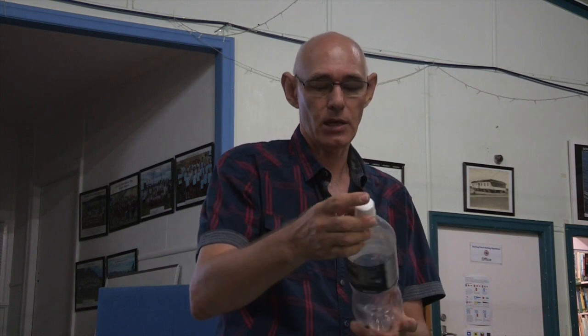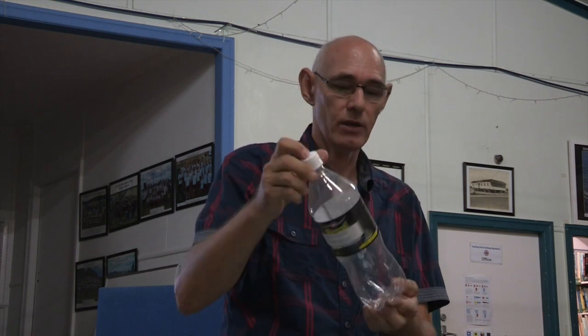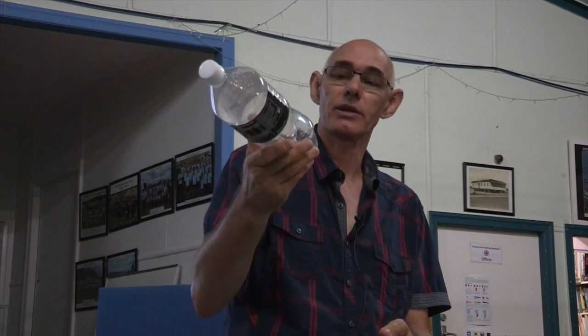So instead of the aircraft industry and car industry relying on thermoset resins such as epoxy, which cure at ambient temperature, they melt this sort of material, or PET, which is polyethylene terephthalate, a really good product. I'll mention that when we get to sales. You melt it, get a die with fiberglass or carbon fiber in it, close it, and under high pressure squish this stuff in, and you get a part. Has anybody tried to destroy one of those?